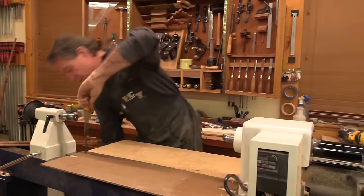And then if you check it out, I applied the same thickness masonite, but this is just a straight cut. So that bears against that curve, and I just slide it right along, and it's going to cut that exact curve above with the piece I just roughed out chucked into the lathe. So let's go ahead and chuck it in there. That's some nice wood chips down my shirt. They feel really good right now.